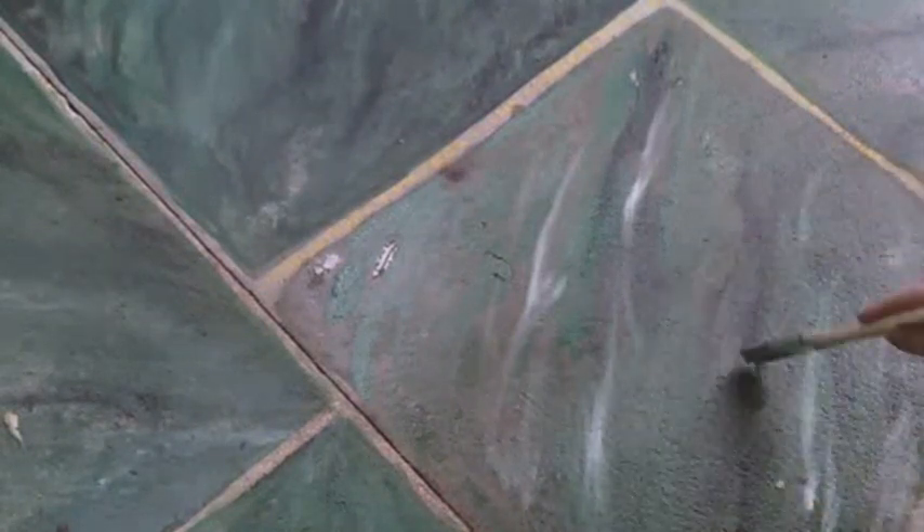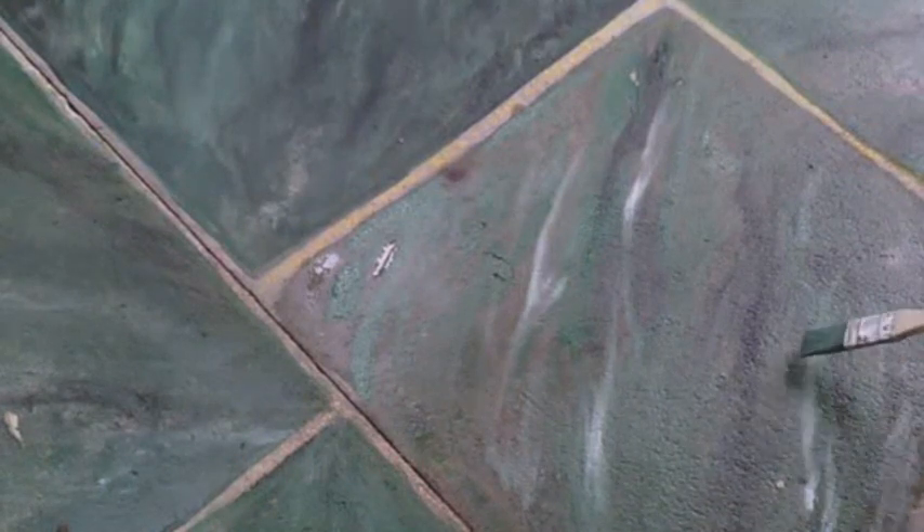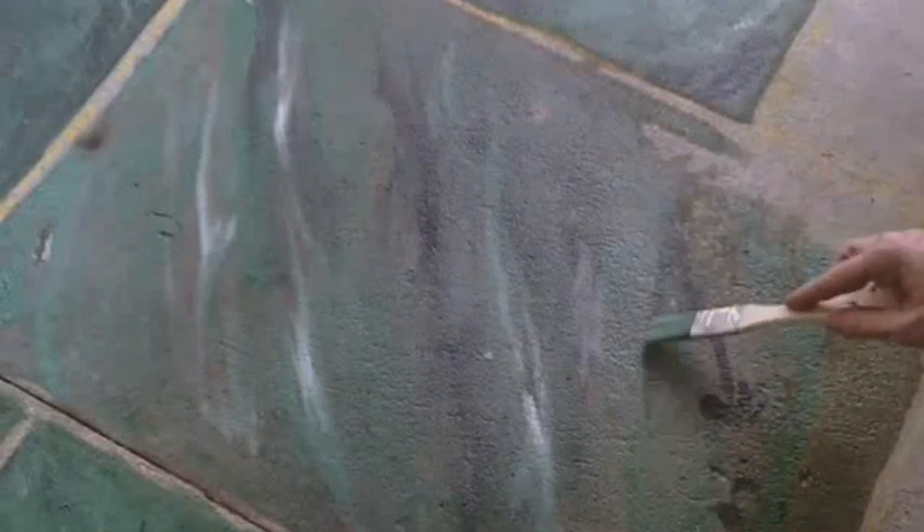Here I am feathering it, fanning it — and it's perfectly all right to go over a square, but you don't want too much paint on concrete because you don't want it to be thick enough to peel off later. You want it very thin and diluted and give it time to soak right down into the concrete. Working with three colors, I'd start with a watery wash — the great thing about marbleizing is it not only hides future dirt, it covers up old stains. Anything that didn't come off with the acid wash I just painted right over it. When in doubt I would always add a little bit of black, because when you only have three colors it can be mind-boggling, but somehow I managed between green, black, and white with a lot of feathering and a fair amount of water.